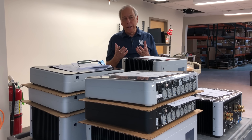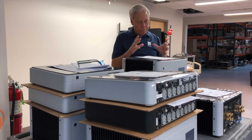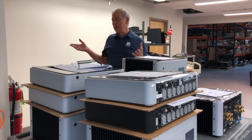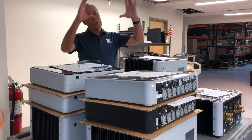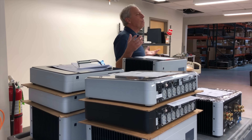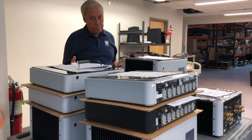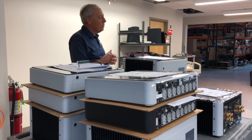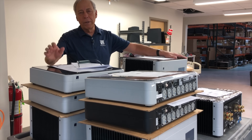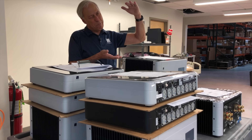We did it because we wanted to have a way for customers to memorialize and capture their vinyl records onto a hard drive. The original idea was: imagine if we could have a perfect analog to digital converter hooked up to your turntable. It's actually pretty easy to make an ADC capable of perfectly capturing a turntable, because turntables have rather limited dynamic range — at their best, they're 70 dB.